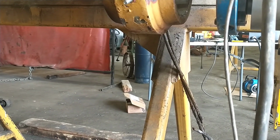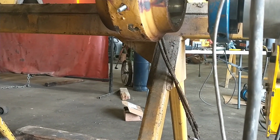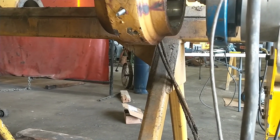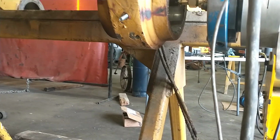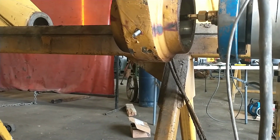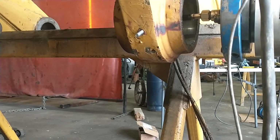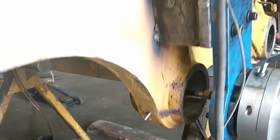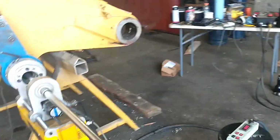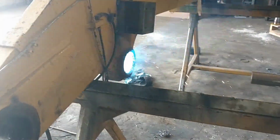So we'll see. If you don't do that, the weld that flows into that hole, because it chills really fast, has a nasty tendency to be drill-wrecking hard. But something I've been wanting to do and keep forgetting is get some different size carbon rods and try sticking a carbon rod in the hole, because I think that's really the answer. But so far, I haven't remembered to do that. So anyway, we're getting set up here to start some bore welding.